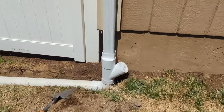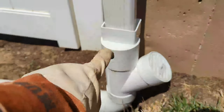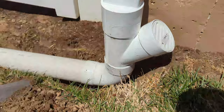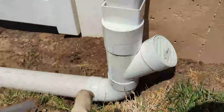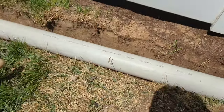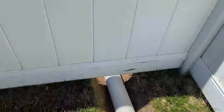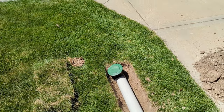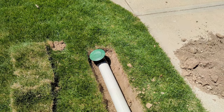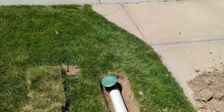Let's get a look at the updated setup, starting with the new downspout coming down into a fitting that ties into the downspout — that's a two by three, I believe, or two and a half by three — down into a Y with a grate. This allows me to clean out the pipe if anything gets blocked. There's a little piece of pipe in between there, down into a street sweep 90, meaning this pipe piece fits straight into that fitting without a pipe in between. Then it comes out into a four-inch PVC — this is the thinner walled stuff — with a coupler, runs down under the fence, and out to a pop-up drain that hasn't been glued on yet. I'm waiting until I finish the pipe, then I'll glue that on, set the pop-up right at grade, and the water will run out and filter into this portion of the yard instead of going under my gate and driveway.